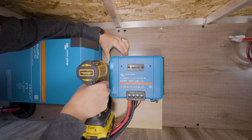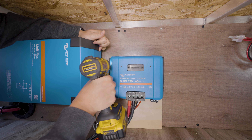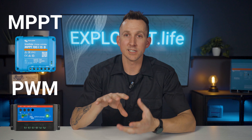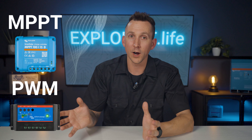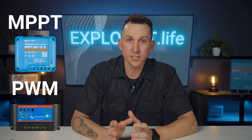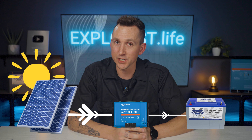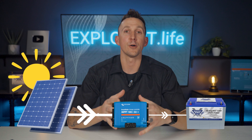Solar charge controllers come in various sizes and specifications but perform the same function, differing primarily in voltage and amperage outputs. The two main types of charge controllers are MPPT and PWM. PWM controllers are a little less sophisticated and are suitable for really small arrays. MPPT controllers, which are newer and smarter, offer more flexibility in wiring and have become much more affordable recently, making them our preferred choice for all of the systems that we sell in our store. As a recap: solar panels capture and forward energy to the solar charge controller, which then regulates this energy into a voltage more appropriate for battery recharging.